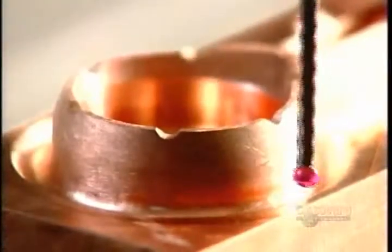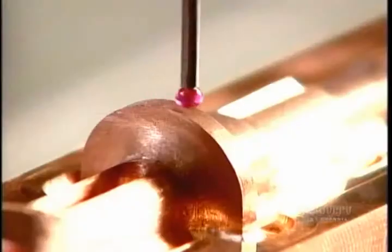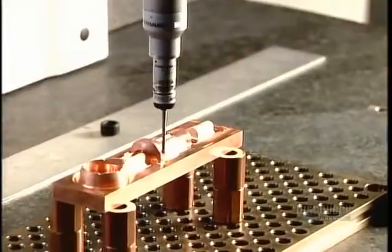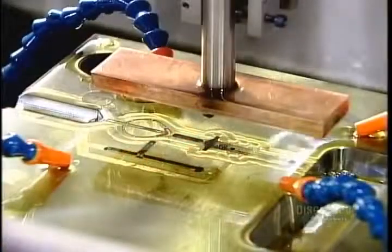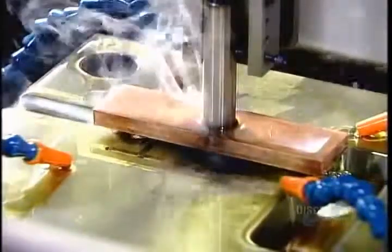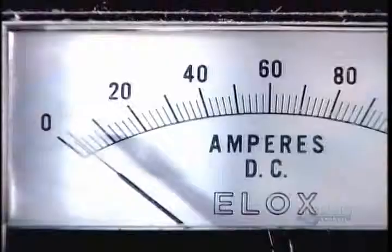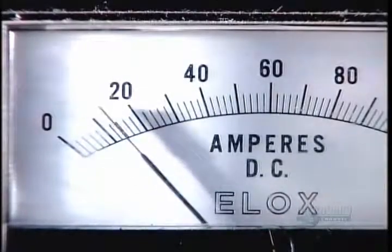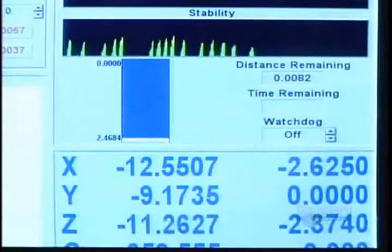After polishing the electrode to ensure flawless casting, they use a sophisticated measuring device to verify the dimensions. The electrode goes face-down on the second tooling machine, called the EDM. Directly underneath is the mold half that's already been partially formed on the first machine. A strong electric current runs through the electrode and penetrates the mold, forming a cavity in the shape of the electrode.